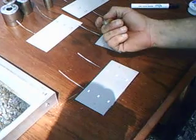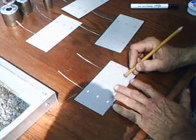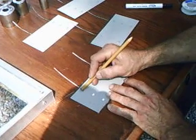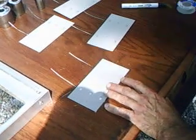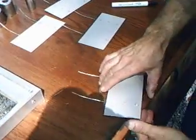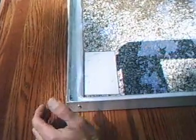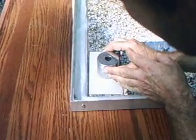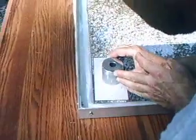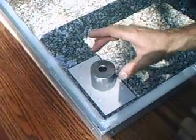Once I get it like so, I've got a little homemade piece of sandpaper on the end of a pencil. You want to rough up the little connectors. The front is negative, and the back side is positive. After you get it cleaned and ready, you simply lay it onto the glass. I'll take a weight and just eyeball it and line it up where I want it, just about an eighth inch in from the angle. I have a table with a hole in it so I can see what I'm doing.